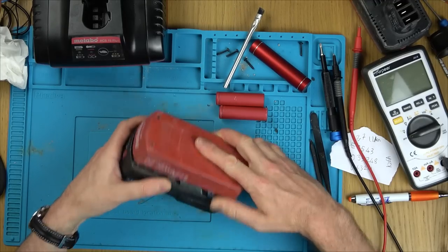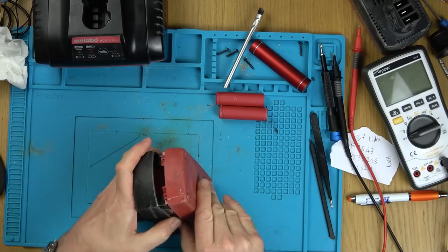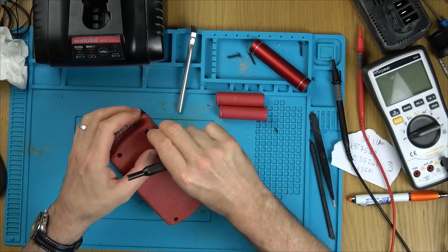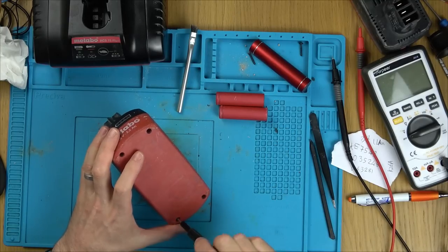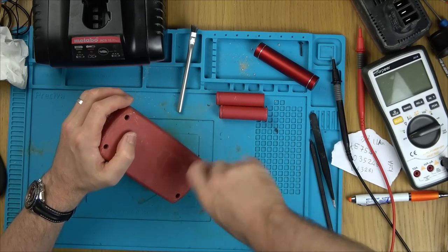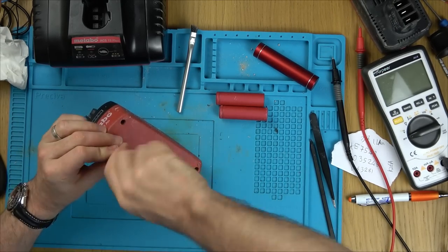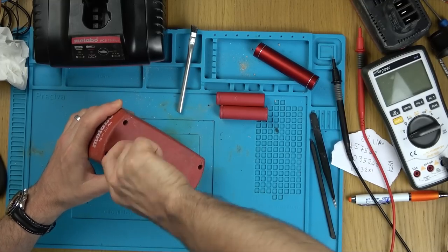So what's interesting there is, when we first all started charging, the new cells were the highest, but coming out of that now, they're the lowest. And I suppose that makes sense, because if something can only go up to 4.2 volts, then if there's not much capacity, it's going to fill up quite quick to that 4.2 volts. But if there's loads of capacity, it's going to take quite a while to get to that 4.2 volts. So these other cells are probably all 100% charged and measuring their 4.2. But this one that I've got might only be like 60% charged or 70% charged or 80% charged.